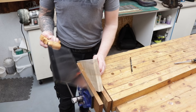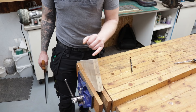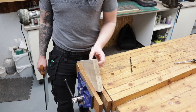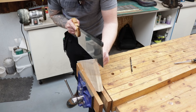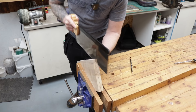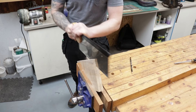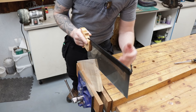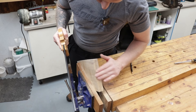We're going to try and split this board in half using the large tenon saw. It's not exactly the ideal saw for this but it has a nice depth to the spine. We start at the corner — that's the best place — and try to join the two lines. Once we have both lines running straight we can get deeper into the board. We want to follow two lines at once. The saw is making short work of it and we're pretty straight.